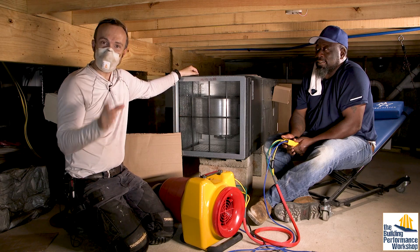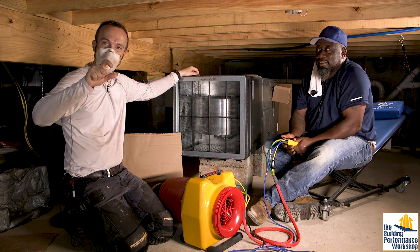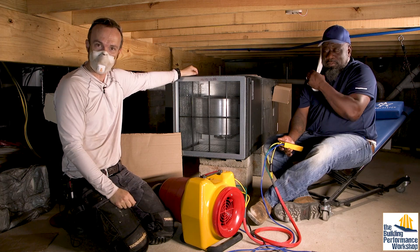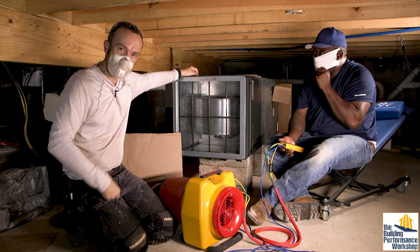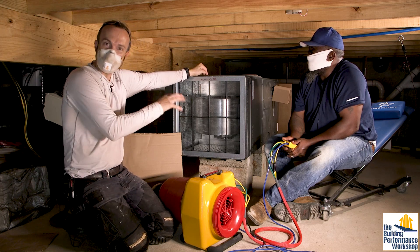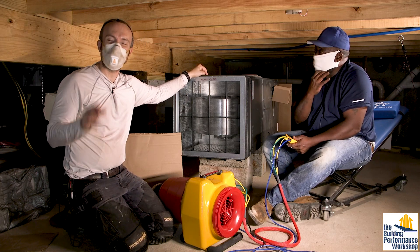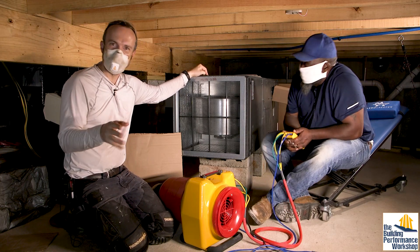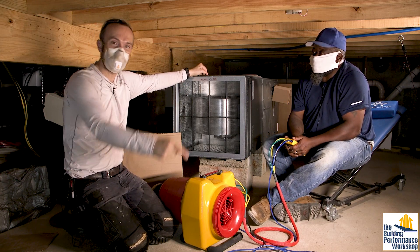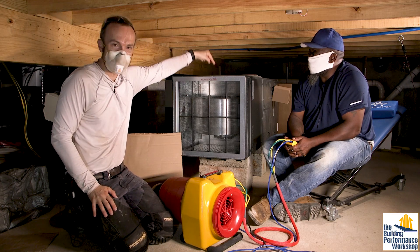One of the things that a professional like Triandris can do for you is take your little silly one-inch filter that you can see through and upgrade it to up to a four-inch filter. I have a two-inch MERV 13 filter that's going to go on this return system. If this box leaks, contaminants can get into the system, and all the air should be coming through the filter — it's able to completely bypass any filter if this is not airtight.